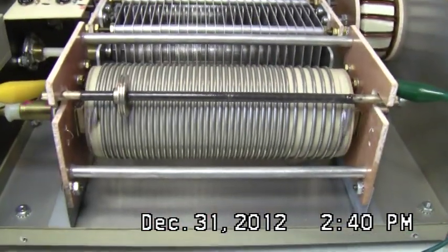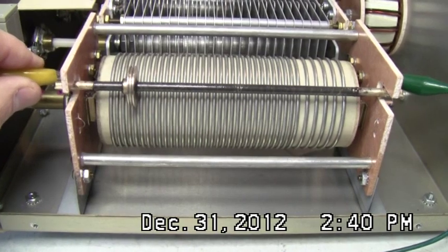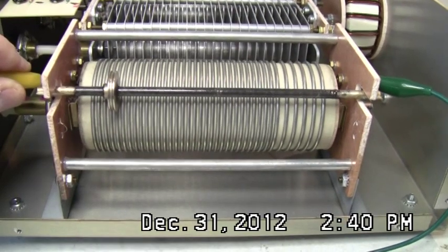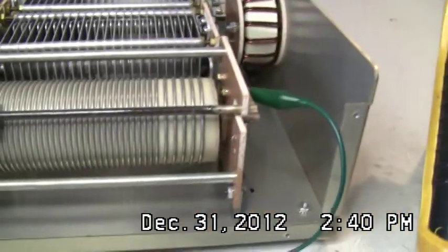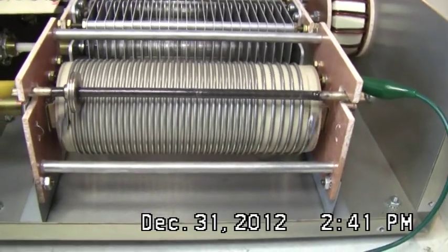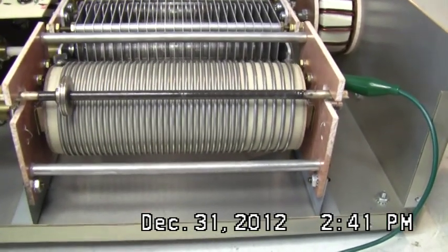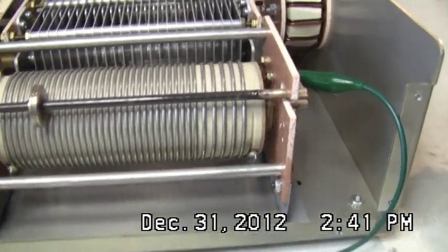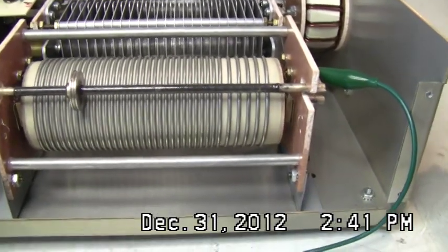That means I have a good connection from this bar, the rotor disc, and the coils all making solid contact. Before I repaired it, it was erratic — as I was cranking this rotary coil it was sounding erratic and the meter was going crazy, showing open and all kinds of crazy things. When you crank it you'll find the bad spots on the rotary coil — it'll get raspy as you're cranking and you'll hear that raspy sound when the tone should be solid.